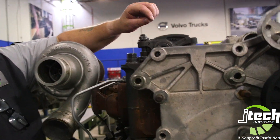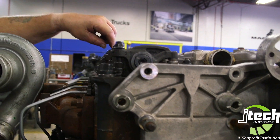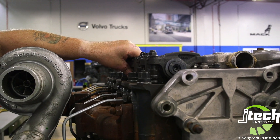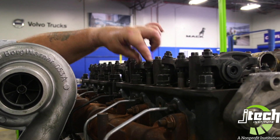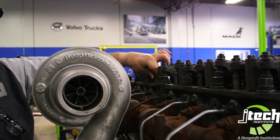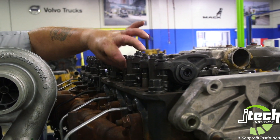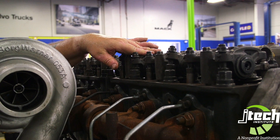If you remember the rhyme — this is the important part — do the first two valves, then you will do one valve per cylinder all the way through the engine, and you don't have to get down off the engine to rotate it. We will do intake and exhaust: intake will be on cylinder two, exhaust will be on cylinder three, then intake again on cylinder four, exhaust on cylinder five. You notice that I can actually turn all of these push rods — they all spin. That means that valve is closed and is in an adjustable position.